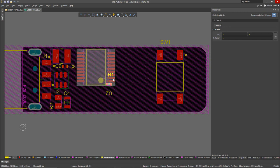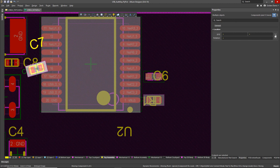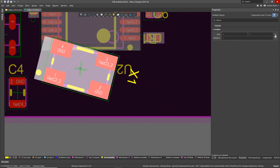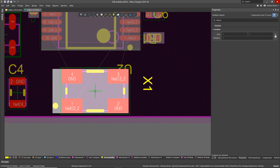Using Component Placement, I can rearrange them and it places them on the cursor in that same order, so I can go about placing them in a more or less ordered, intelligent way. Rotate them and orient them — you'll notice I have a smaller degree for rotation in my preferences, but you can of course adjust that so you can place things at any kind of angle you want. There's the crystal, so I'll place a few of these things, just using the space bar to rotate them.